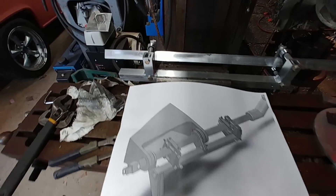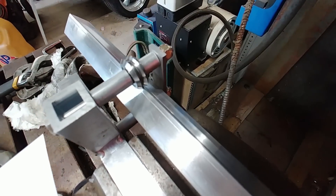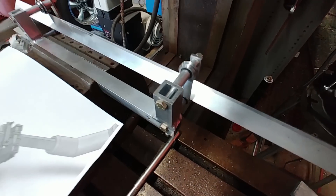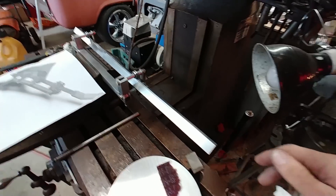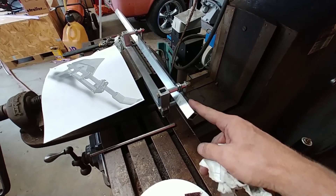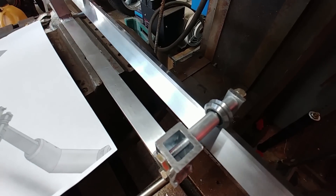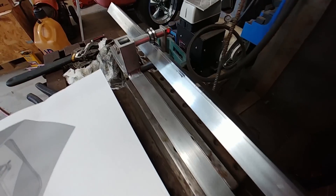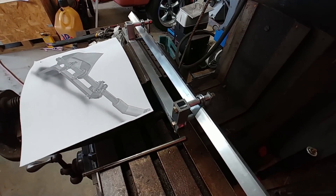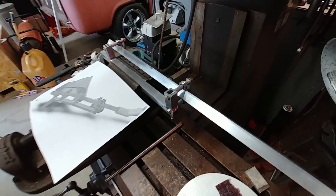All my metal arrived late Monday afternoon. Now it's Tuesday, up at Brett's, and I've actually got the prototype or at least part of it already put together. I didn't take video of putting it together because I wanted to knock it out quickly, but I'll get video of the other one. I've got my square tube running in between the bearings, I've made the thing, I've got the adjusters in there for adjusting tension, and it runs smooth. You can dial in the amount of pre-tension you want on it.